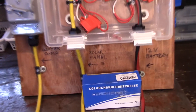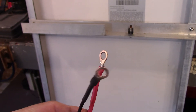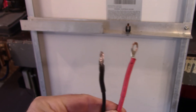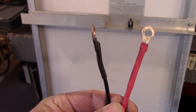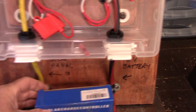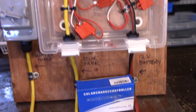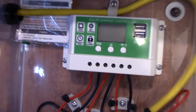This one here goes to a battery — it's going to be a deep cycle battery. Here are the two connectors on the end, because deep cycle batteries just have a threaded post with a 5/16th diameter post and a wing nut; you just tighten these down. All you've got is black and red, and that's it. Now let's take a look at this charge controller — I bought it online off Amazon for 13 bucks. I've never used one of them before at that price, but I'm going to try it.